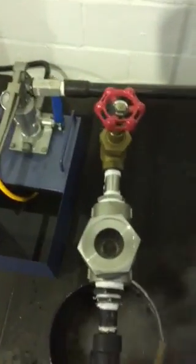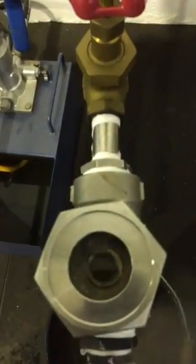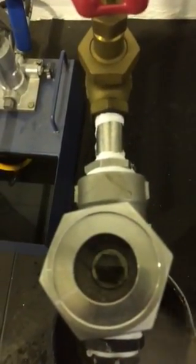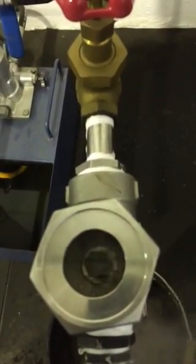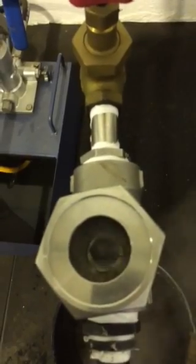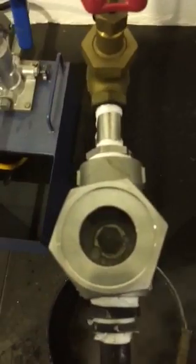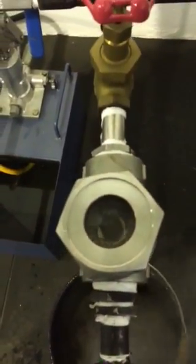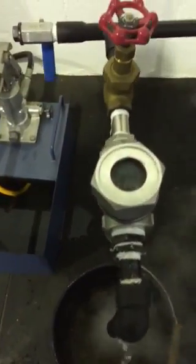When we look in the top of the trap you can see in the window the occasional bubble as the steam comes right through the insert — so the steam is right here at the insert. When you see the bubbling of the trap you can hear the discharge sounds and the bucket underneath at the same time.